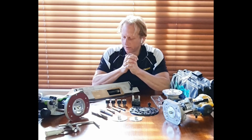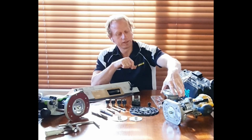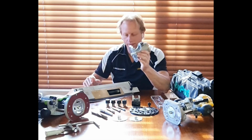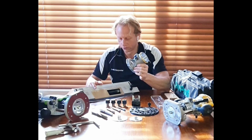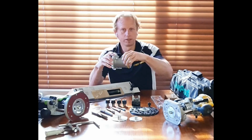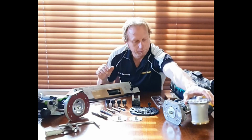And what's another thing to mention? These trimmers can fit into the plunge base, and they also fit into things like this, which is okay for doing butt hinges. If you just set the length that you need on the hinge and you just drop it in, do the cut, take it out again, you'll still get effective dust extraction. So that would be fine just for doing butt hinges. It won't be good for doing concealed hinges where you need to plunge. So I just always recommend having the plunge base and not even using something like that. But you've got the option.